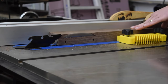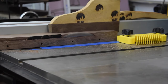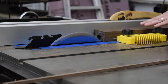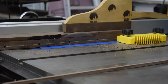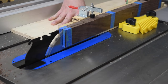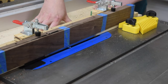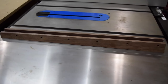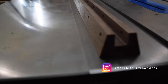You can see now why I drilled the holes before making this cut. With the first cut complete, I flipped the piece around and cut the bevel along the other side. I designed this piece with an angle along the back. To make it, I taped the offcuts from the bevels onto the workpiece and built a sled. This allows for the taper to be square and gradual. The result is one piece with compound bevels that allow for some real visual weight. This also allows jackets to hang more staggered once mounted.